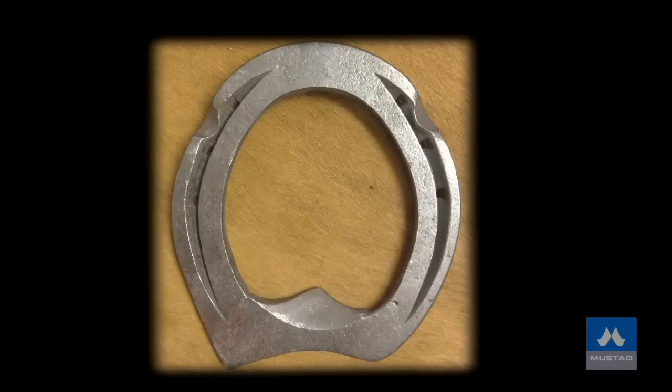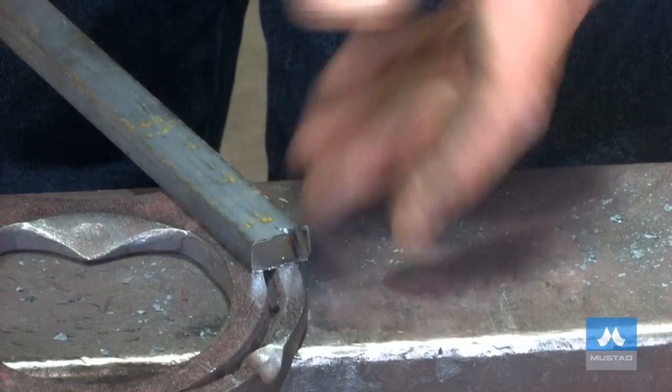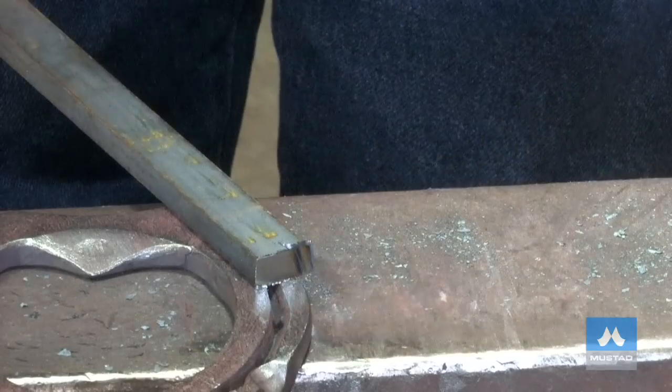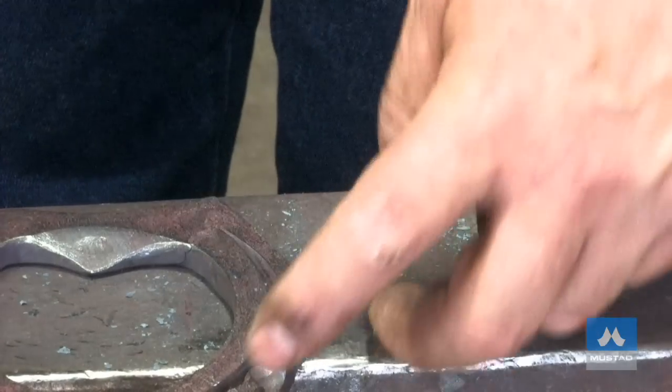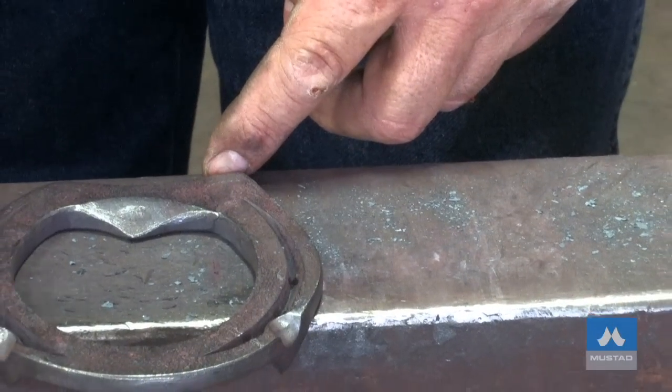When I look at the picture, I can see it's a lateral extension. My bump starts basically at my first toenail and it goes to the end, getting slightly wider as it goes to the end. We can put normal steel on the shoe and we can see there's quite a big lateral extension. We've got to upset quite a lot of material, starting at the toenail at zero and coming to maximum bump at the heel.